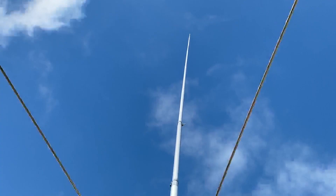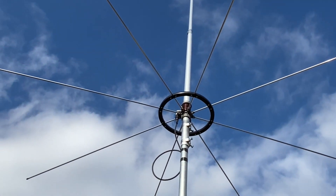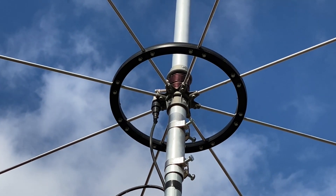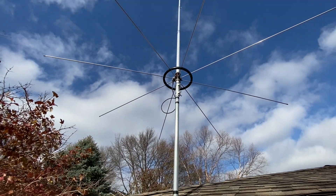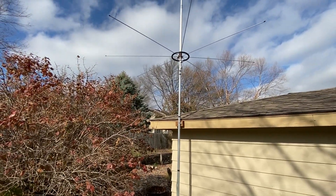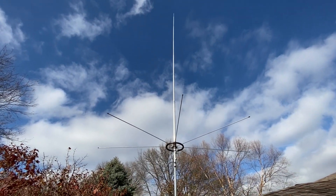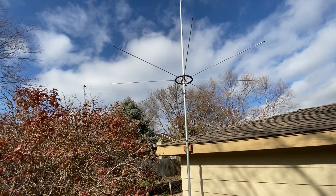Going all the way up to the antenna — this thing has maintained straightness pretty well, I can't complain. I did pay more money for this plastic ring that holds the radials, because it keeps them from vibrating in the wind and coming loose, and also offers some support if birds happen to sit on them. I've never seen a bird on this thing, but I'm literally only 10 feet off the ground. And in the past year I've talked to South Korea, the Bahamas, Jamaica, and the UK from the middle of Iowa. So it'll still work for long-distance skip talking. Don't feel like you can't participate in the base antenna game if you live in the middle of the suburbs like I do.